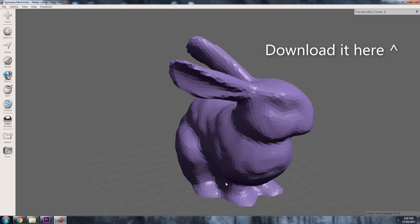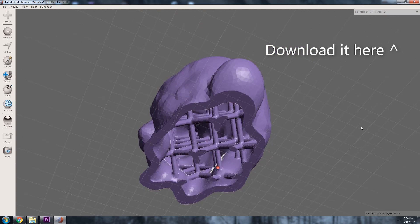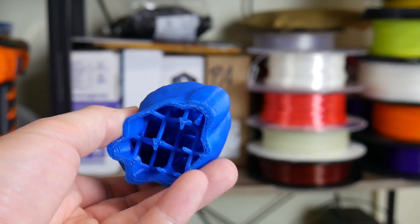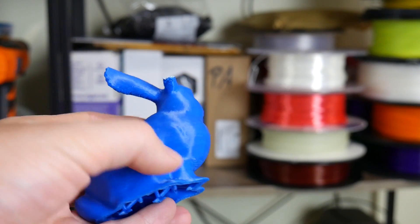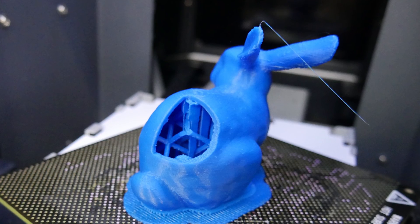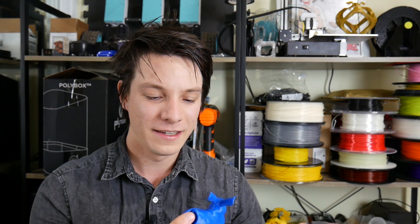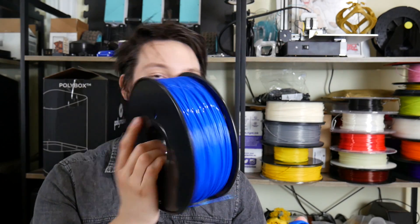The model I decided to use to test these filaments is a bunny with an infill lattice — it's actually quite challenging to print. I originally designed it for an SLS test I sent to Formlabs, but I tried printing it in FDM. To my surprise, the cheapest filament I own printed pretty much flawlessly. Printed at 0.2 millimeter layer heights, it doesn't look fantastic — detail resolution on ABS isn't so high because it's a bit globby and the pigmentation isn't fantastic. But for an everyday ABS, I could print with this stuff all day. I actually bought a couple of rolls in different colors because it prints so well.